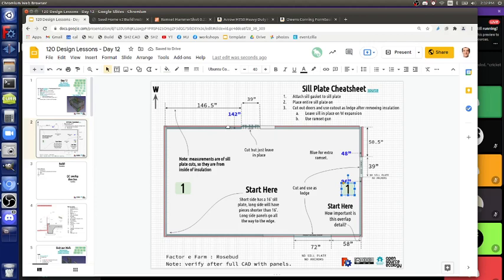Now, when we're working out there, people can be doing the top plate. But first, it's kind of messy around it, so let's bring the weed whacker and shovels and tools, because Jeff kind of smoothed out these three sides more or less. There are still materials there. We want to smooth that out on the north side and the west side. Let's swarm that, all of us get shovels and the weed whacker, get all the materials out of the way and cleaned up, so that we can put on the sill plates. You put on the full sill plates, then cut out the notches, is what we do.